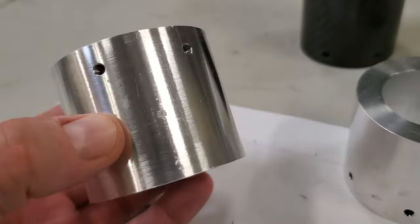Another issue is the go-to speeds are way too slow. And I'm not sure if that's something I can fix in software. I may just be way over geared. So I will look into that. There's also a strange behavior that I think is when manually guiding, pushing buttons to manually slew the telescope. And I think that's mainly related to very slow acceleration and deceleration values, more tweaking.